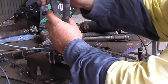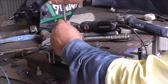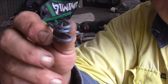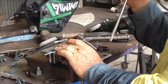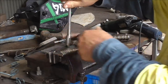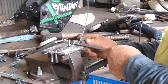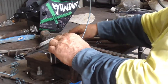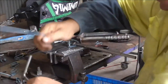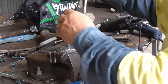I cut the wire one inch longer than where the little post is, and now I feel like I'm really starting to get somewhere — I can knock them out pretty quickly. I think there's one little improvement I could make to these clips. I've got a good inch sticking out past the end, and this time I'm going to change how I make the clip just a tiny bit. I'm bending this around further than in the original clip — the legs are bent around a lot shorter, which makes the screw become completely encapsulated in the clip.